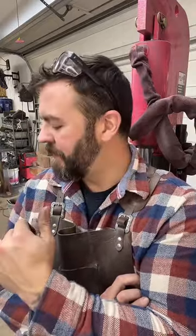How hot does it have to get to weld together? So, when I'm doing regular Damascus, I want to be around 2100 degrees. If I'm doing something with copper in it, I need to be below 1984 degrees because copper melts at that temperature. Brass, I need to be below 1800 degrees. Now, steel will still move at those temperatures, and you'll be able to braze the non-ferrous metal to the steel. It's really what you're doing. It's not welding. But yeah, for normal forging and normal forge welding, about 2,000 to 2,200 degrees. Anywhere in there works.